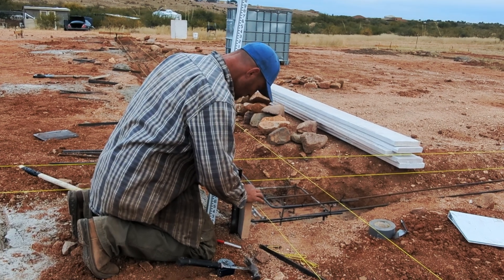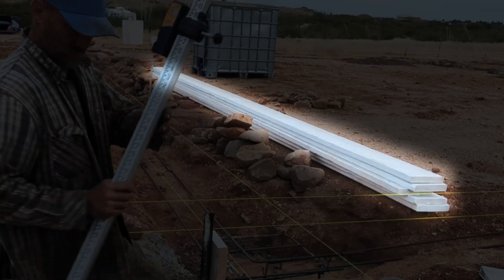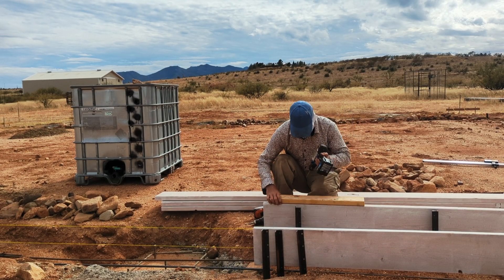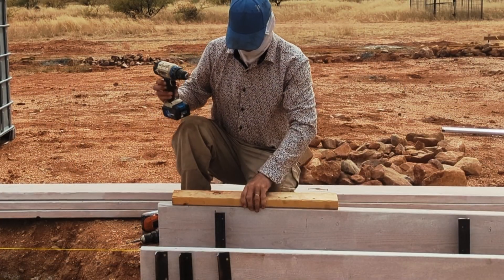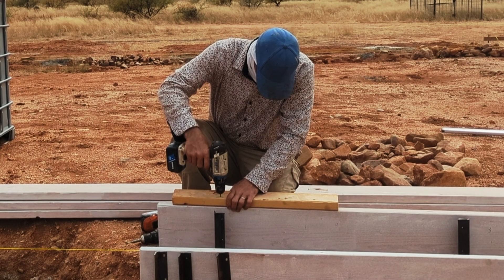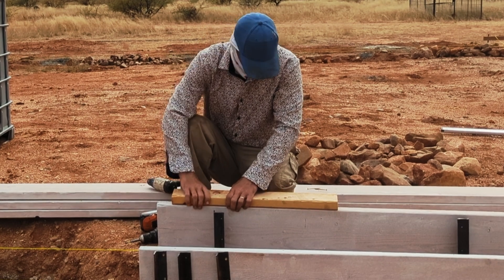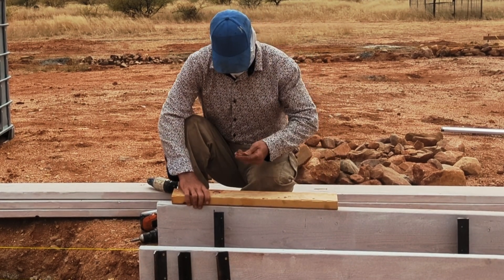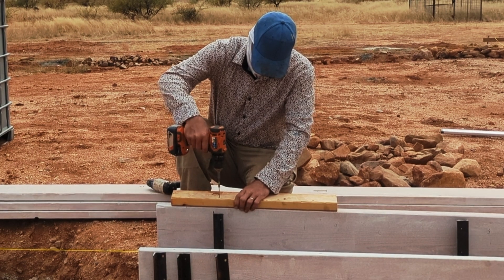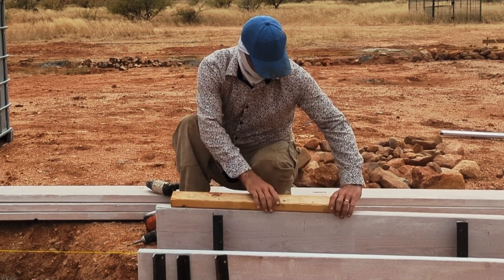It's important to point out that I have 20-foot-long two-by-ten pieces of board here that are really heavy, and to do it by myself there's only one way I could do this. You can see what I'm doing: I'm making a lip — basically I cut pieces of two-by-four where the stakes are and made a lip, and I'm going to be screwing these pieces of two-by-four on the ends. Then I'll be able to lift up this form and set it down on top of those stakes. Because I used a grade stick I'll have them almost exactly where I want them — I might have to make micro adjustments, but this is a way I was able to do this DIY style because there's nobody else out here to help me.